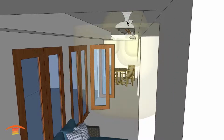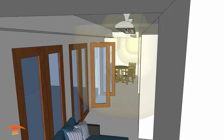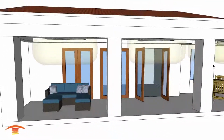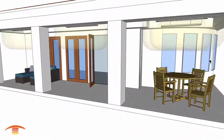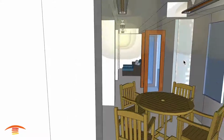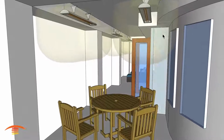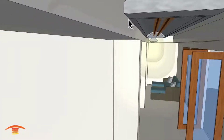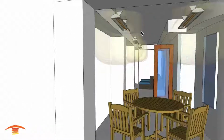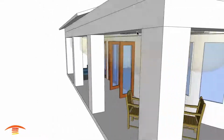And with the 3 inches of heater surface here, you should get that total drop of 1'3". So that should work out fine. And you can see here how I'm meeting the clearances between the columns, and I'm also meeting the clearances between the surfaces of the edge here, this soffit part here, and I'm 6 inches away from here, and again 6 inches away from this edge here. All right, with all 4 of these units with a drop bracket or extended bracket.